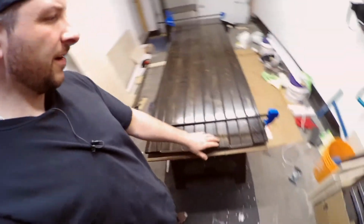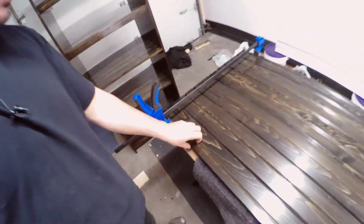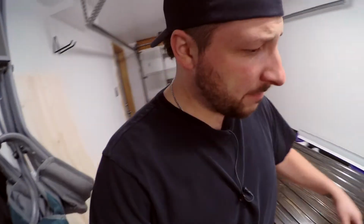So we got her all set up here, as you can see there. Got her clamped along, kind of bowing up. Some of the boards were extremely bowed, right? These are just clamperoos, as you can see. Just push them together. Like I said, they're bowed. Now what I'm going to do is take that right angle, measure out the length of this on this guy, and on the other side, place the metal over it with two screws per board into the end. That'll hold them together on the ends while giving it some rigidity.